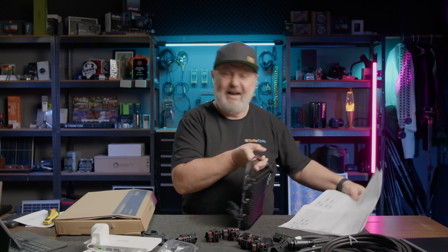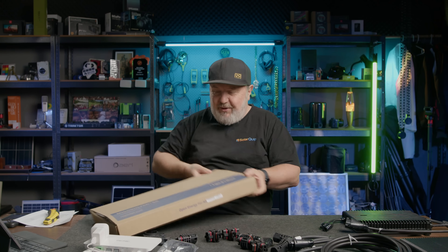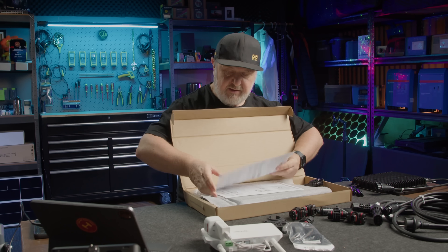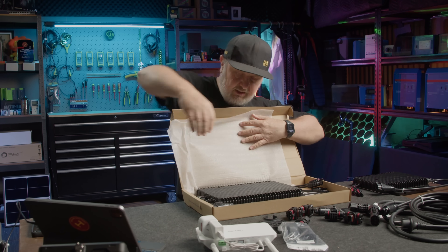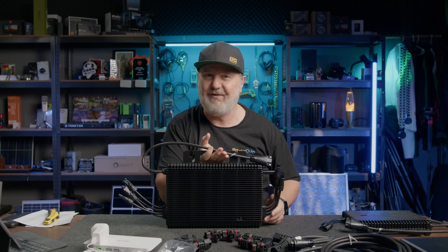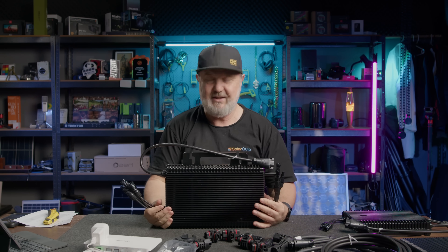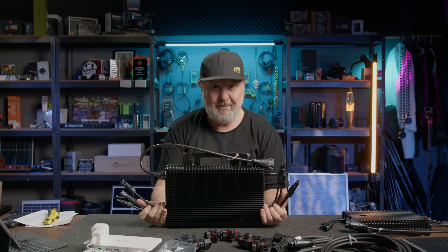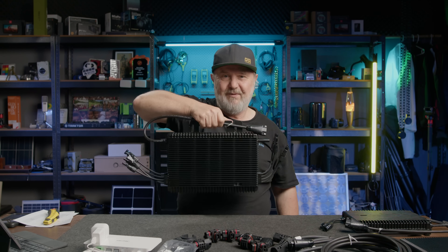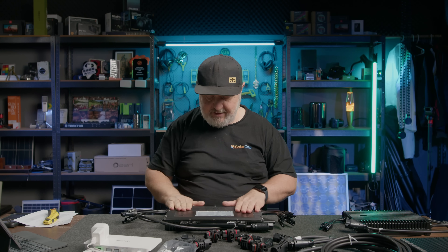But wait, there's more — big bertha here. Quick start guide. And, whoa, that is one big micro. It's kind of funny they're called micros, but this is a four MPPT. Four MPPTs in a package this small is pretty amazing. It's rated at 2000 VA. I can remember installing two-kilowatt inverters that weighed like 30 kilos — this is three or four kilos, something like that, pretty light. Really changes the game in terms of cost and speed.